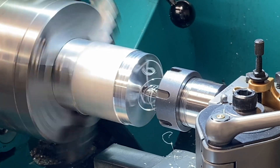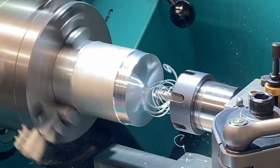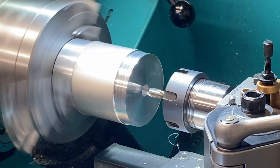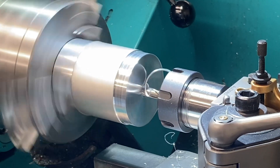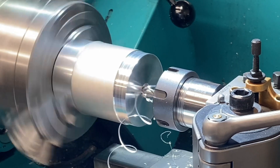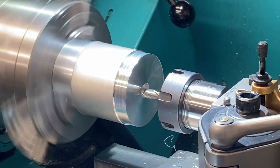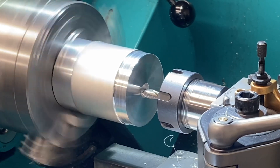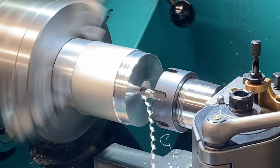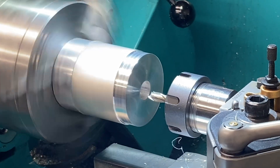That's all quite civilised — no chatter at all, really good. In a moment I'm going to take another cut and increase the spindle speed. We'll take another two millimeters depth of cut. Absolutely no problems there with two millimeters depth of cut. Let's try something even bigger — three millimeters depth of cut.